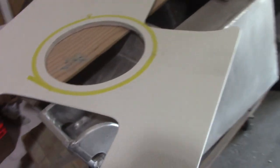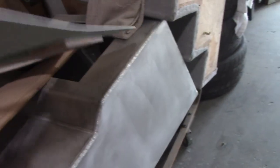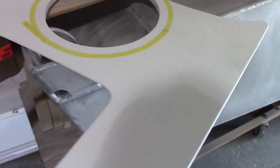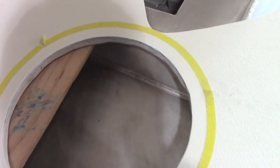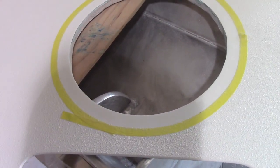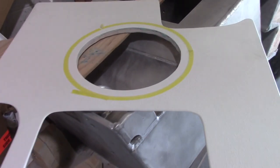For the starboard side cover, it's thin — just thin glass — and we've added some wood where the opening is. On top we've sprayed a non-skid to match the existing non-skid. The hole here is going to be for an inspection plate, which gives us access to glass inside, in case water gets in, and also for fastening the little pods in place.